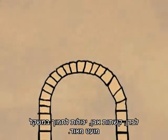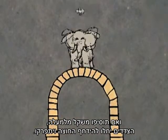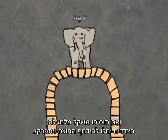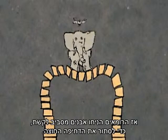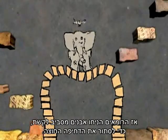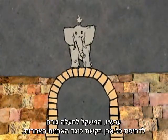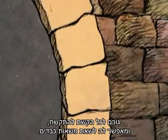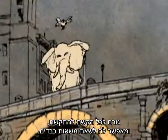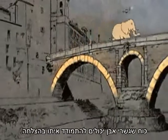By itself, the stone arch can support very little. And if you add weight to the top, the sides will start pushing outward and crumble. So the Romans placed stones around the arch to counteract this outward thrust. Now, the weight at the top serves to press the individual arch stones together, making the entire arch rigid and capable of supporting very heavy loads. This pressing action is called compression, a force stone bridges handle very well.